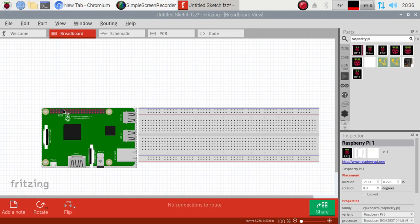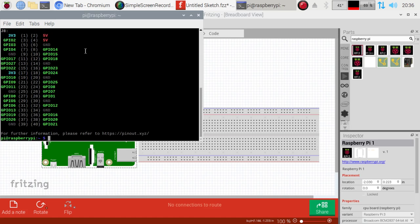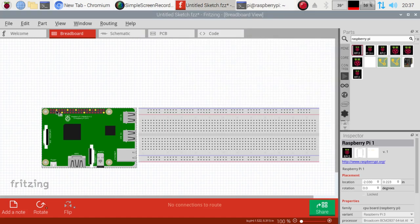If you do not know your pins for your GPIO, if you hover over the pin it will tell you exactly what the pin is — quite handy. You can see the pin out for our Raspberry Pi: three volts here, five volts up here, five volts ground, GPIO2, GPIO3. This gives you more understanding of where you're going to want to link everything. Pin 6 is the ground, so we're going to take that and bring it over to the ground on the breadboard.